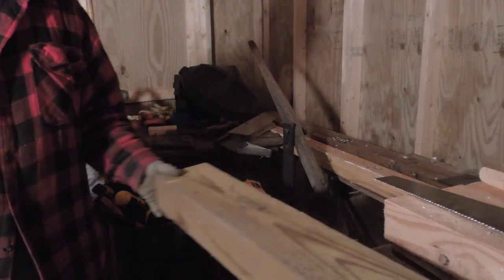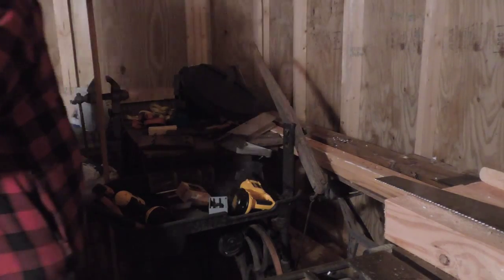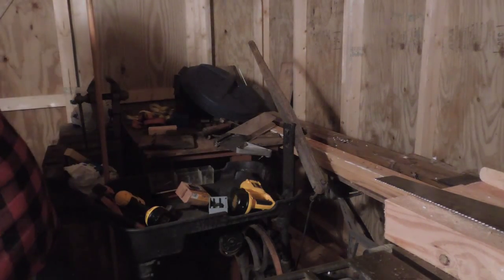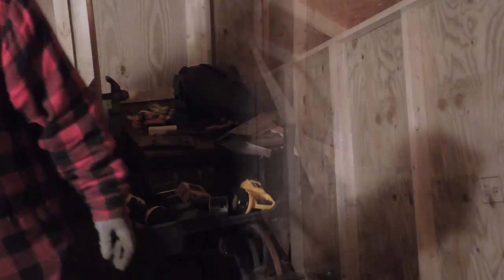And I've started my workbench — it's going to be a beauty. The thing you want on a workbench, especially for hand planing, is something that's really solid. I'll be able to mount my bench vise on the end of that and I'll be able to plane on that bench without any problems at all. Even though it's made out of pine, it's four-by-sixes. And it is treated lumber — not everybody wants to use treated lumber, but it's what I have so that's what I'm going to use. Thanks for watching.